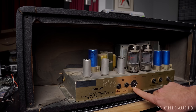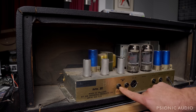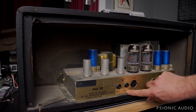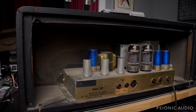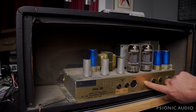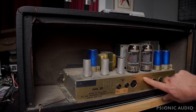Like most of these, the impedance selector switch is missing its knob — probably because the switch goes flimsy over the years. So someone rewired it so the 8-ohm tap goes to this jack and the 16-ohm tap goes to this jack, with a label there. As long as they did a good job, that's a fine solution. You can see there's a silkscreen dot here where they could have put a selector switch but did not.